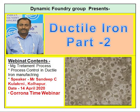Slag in ladle and pocket, as I told you, slag in the pocket will also cause a problem, because if the pocket is sluggish and it contains slag, then your magnesium and covering punching will not fill properly, and sometimes it comes out of the pocket, and then your reaction will start early and you will not get the desired magnesium recovery. So you have to take care that your pocket is always in good condition, free from slag and other material. Even sometimes some metal is there in the pocket. I have seen and experienced in my career that sometimes there is some metal inside the pocket, and because of that, whenever you put the magnesium inside, it will start burning a little early, and your magnesium recovery gets affected.